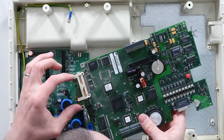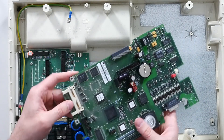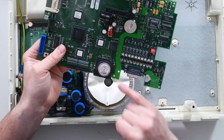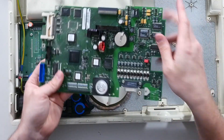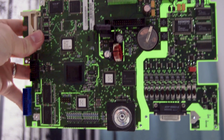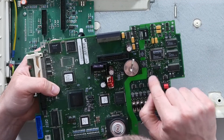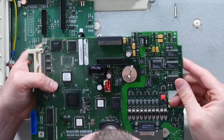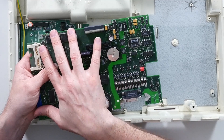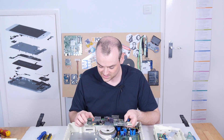This IC in the corner next to the expansion port is actually a SanDisk IC — I wouldn't be surprised if that's a controller for a memory card. There's actually a decent amount of processing power on this board. You can see this massive divide in the board where you've got two very separate sections, only bridged by a couple of components. One's clearly transmit and one receive — they're literally rotated opposite each other. So you've got what could be the patient-facing side over here and the non-patient-safe equipment on the other side, separated on the board. That's the medical-specific design I was expecting to find.